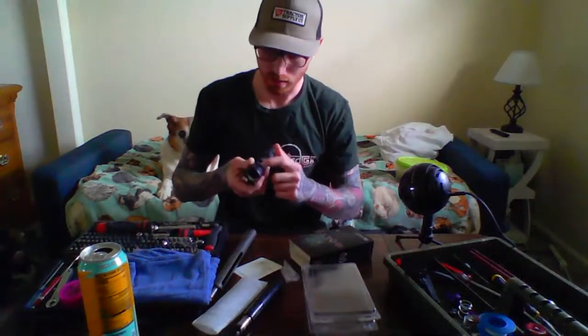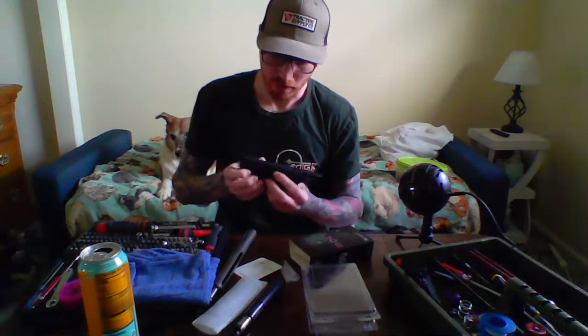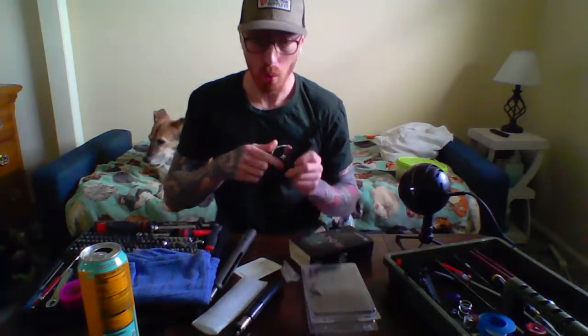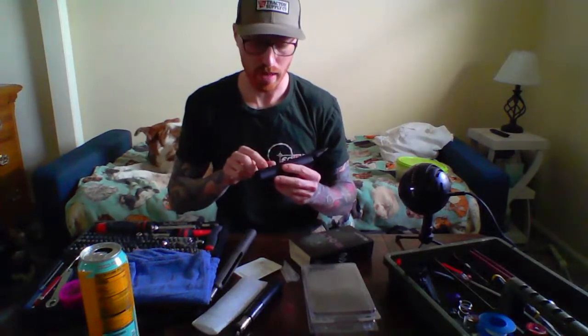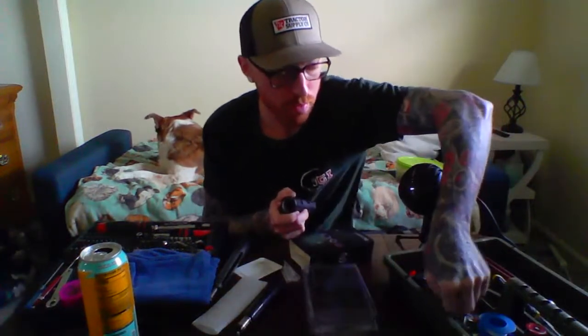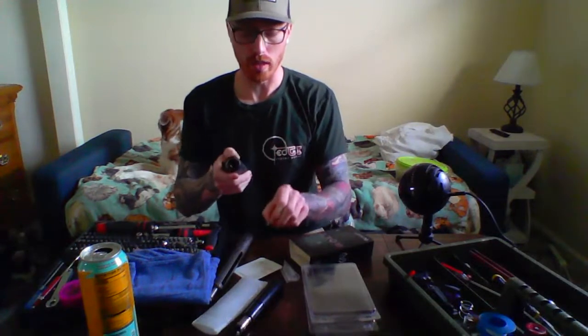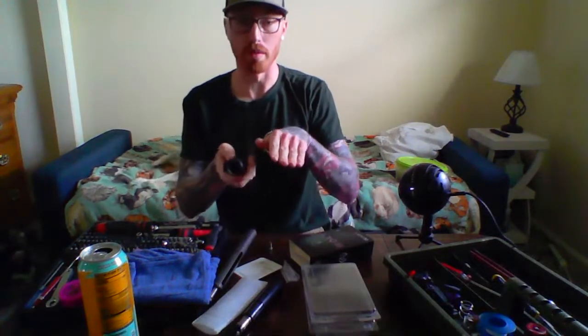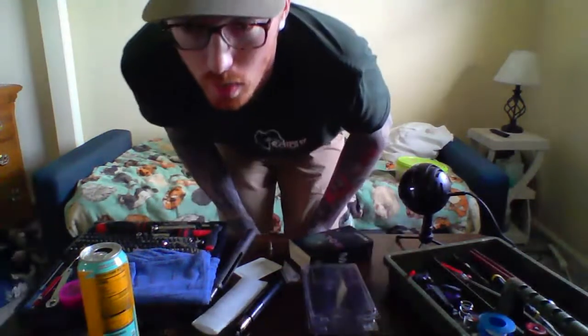I like to drill the fitting hole behind the threaded hole for the body screw. Some receivers also have a gaping hole straight through — you're going to have to drill around that. When you drill the hole for the fitting, you want it to be as snug as possible because the fitting is one thing that keeps the bolt on the cylinder pretty sturdy.